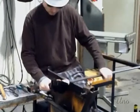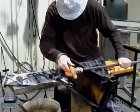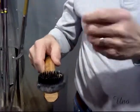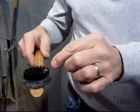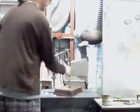All right, now the best part about the clear glass is that it's a vehicle to carry the design. We're going to add some raindrops. Every time you poke it with that, wherever one of these little pokes is, we gather clear over it, and a bubble will form. So now we have bubbles, raindrops. Wow. Now we've got, coming up, the rainbow. You see it's a rainbow color.